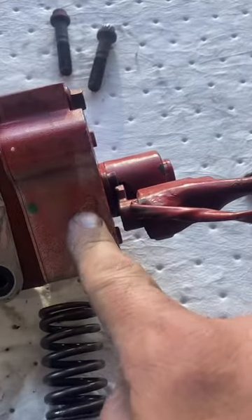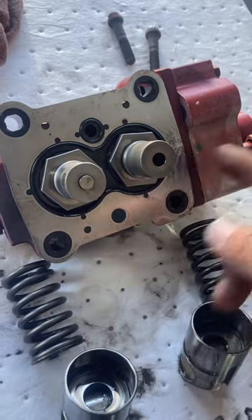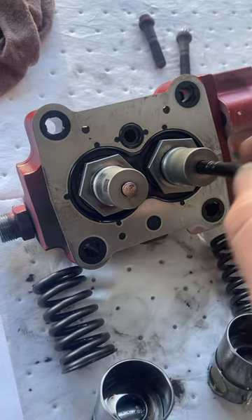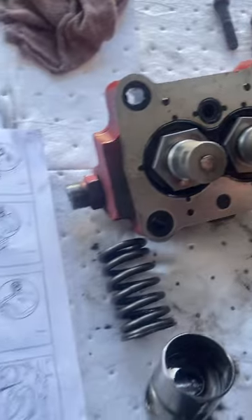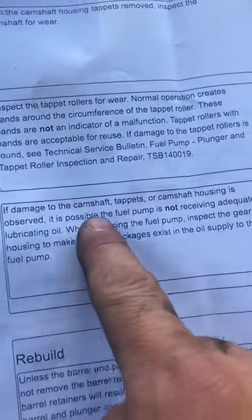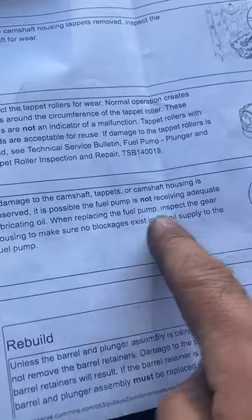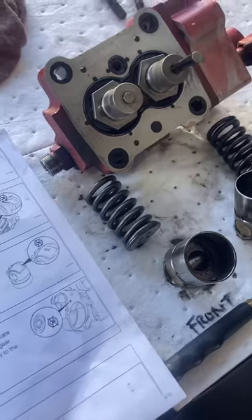This is your fuel pump actuator here on the back. It also says to remove this and blow some air through it, but since we're going to be replacing basically this whole pump assembly, that's about it for the inspection on your fuel pump. If you see these signs — which are common on the ISX — of scoring and pitting on the tappets and camshaft rollers, this will cause further damage to your engine. If damage to camshaft tappets or camshaft housing is observed, it's possible the fuel pump is not receiving adequate lubricating oil. When replacing the fuel pump, inspect the gear housing to make sure no blockages exist in the oil supply to the fuel pump — definitely want to check that before you put everything back together.